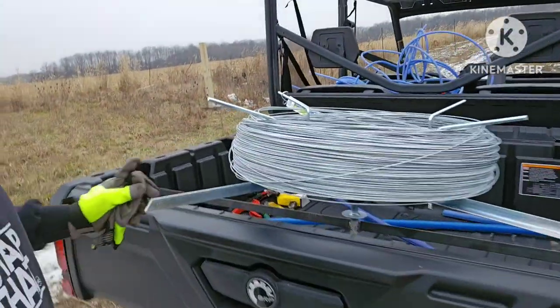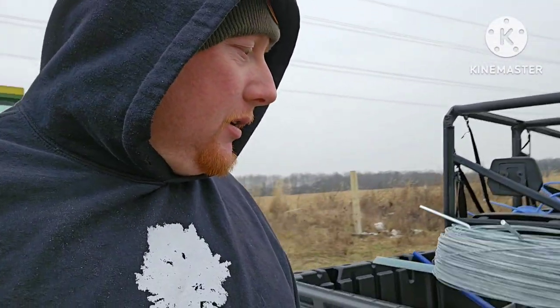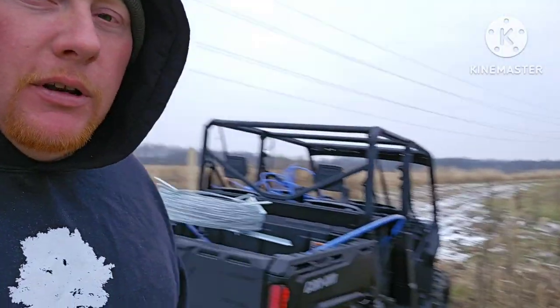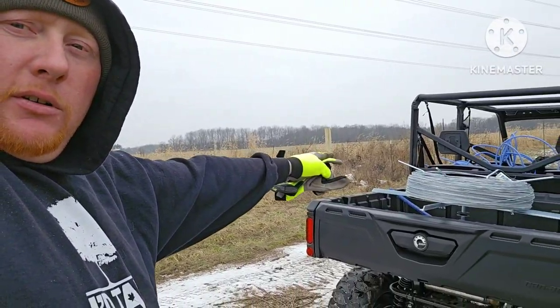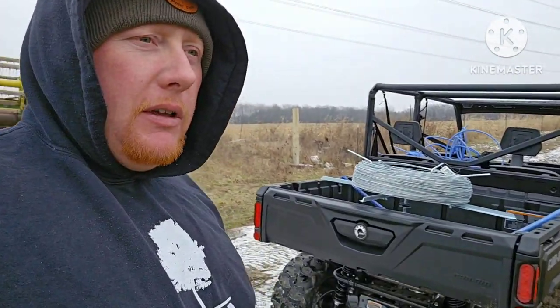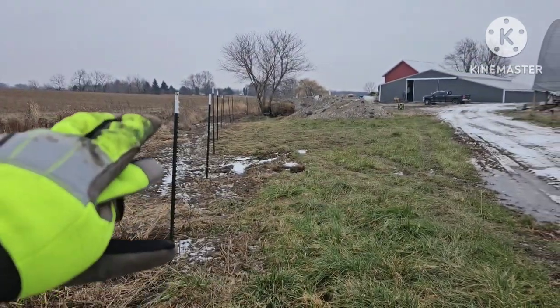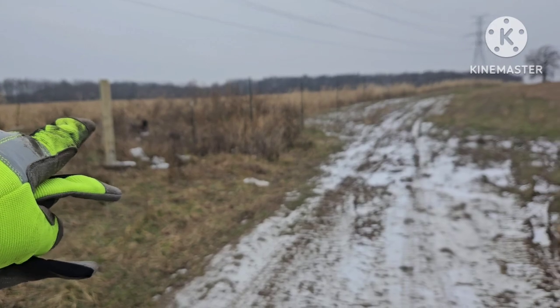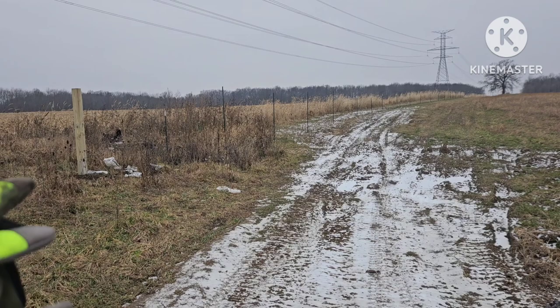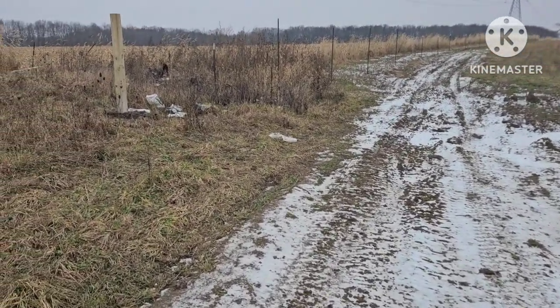I'm just kind of showing you guys my project for today. Made up this spinning rig here from the back so I can actually just drive along and unreel it once I tie it off, or just pull off like I'm gonna do here. This is gonna be one of the set posts - my line is gonna come right here. It's gonna have a disconnect between here and that other post over there so you can drive through here in the summer. Every hundred feet I'll just put a little clip holding the line up, then I'll start setting tension and grade at another time.